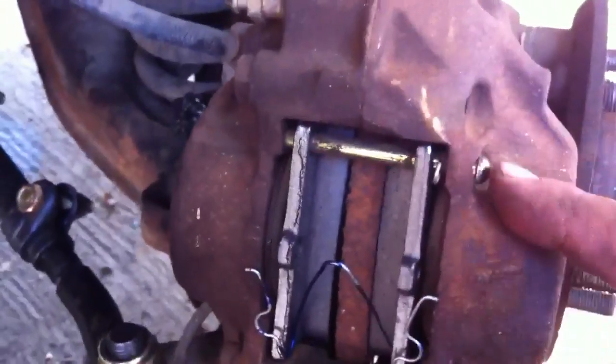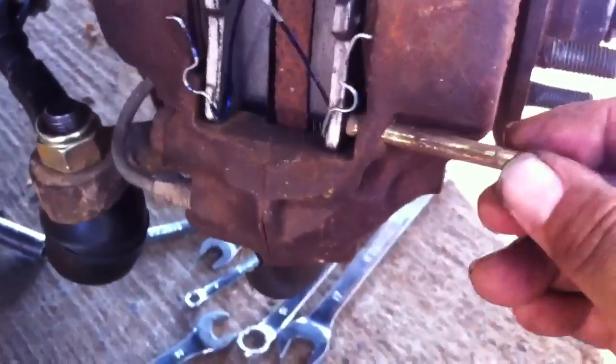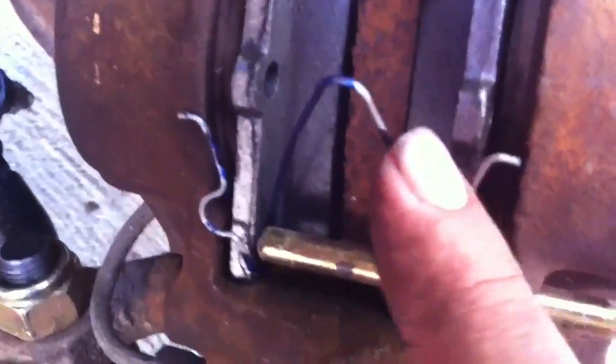I'm going to show you on this side. You slide the pin in, put your keeper key right there. Then you take your spring — which stops it from chattering and keeps it spread apart. On the bottom one, you put it through the outside, it hooks onto the first pin, then goes on the inside. It slides all the way across, hooking the other side. Once you get that all the way through and hooked, these pins go back into place on either side. Then your keeper key goes into that little hole — you can see that little hole right there — and the other keeper key slides right in the same way.